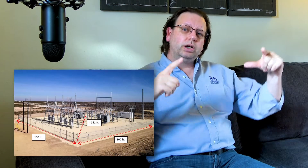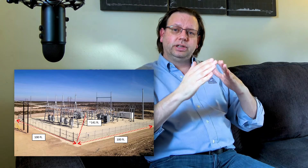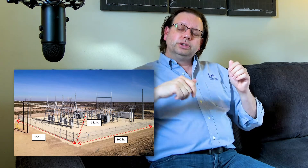In other cases — particularly in a substation — we're trying to clamp onto a single electrode inside of a larger, massive parallel network. Take our substation example: a 100 by 100 square grid with lots of cross-conductors and ground rods distributed throughout. Assuming we can inject current down one ground rod, through the earth, and back up all the other ground rods, we're measuring R1 plus R2 — R2 being the rest of the grounding system. We get an artificially low resistance to ground because of massively overlapping spheres of influence.